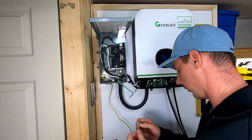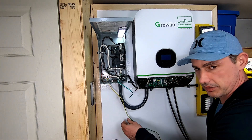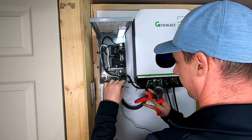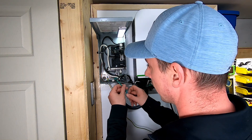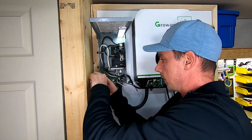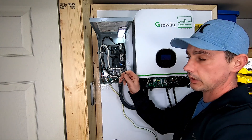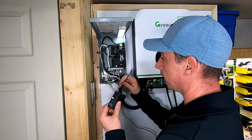Now like I was saying with the grounding electrode, it is also just a stranded wire so we're going to want to use a ferrule. Now I'm grounded out to my house through this wire here - this is severely under-gauged but it's just temporary while I hook it up. Now I'm going to connect my ground wire first, then my neutral wire. For my hot wire, this is only a 14-gauge wire, rated for 15 amps, so I'm going to use a 15-amp breaker on it.